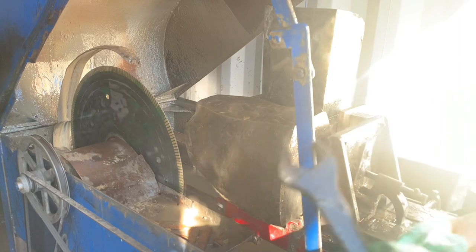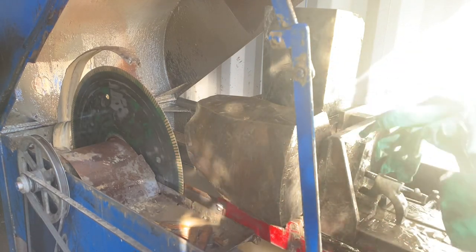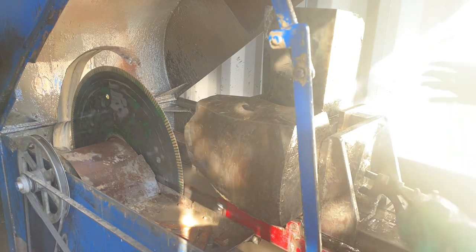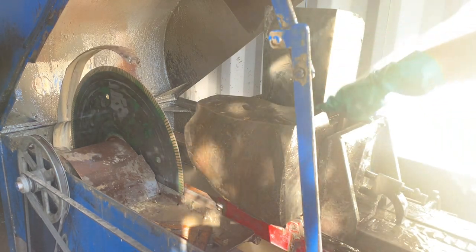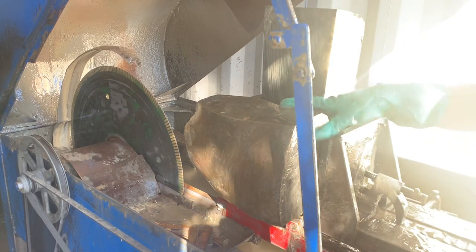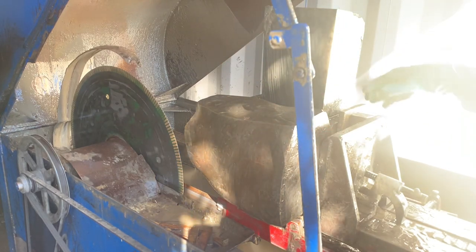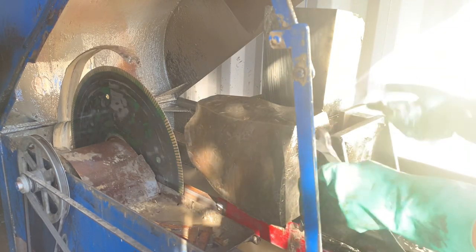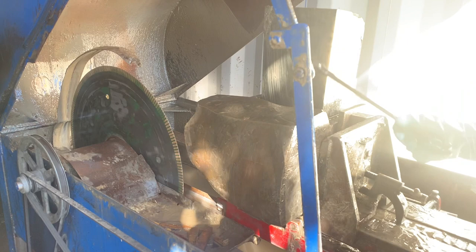So I'm using this big chunk of Wyoming jade, olive jade with quartz. Gorgeous stuff. Makes a great heavy counterbalance when you're trying to hang your stone out. You don't want it to be dipping down as you try to tighten it. So this pressure keeps my backboard from getting lifted up on the lever that's created underneath this.